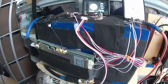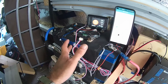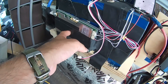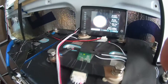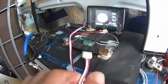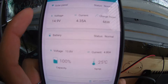Then I have this DIY battery I created — four 3.2-volt cells, 12-volt battery, 280 amp-hour capacity. This is a JBD BMS system that lets me monitor what's going on. It came with a handy LCD as well as a Bluetooth device. I also have a Renogy Bluetooth monitor up here showing system status.